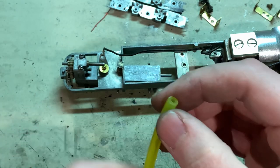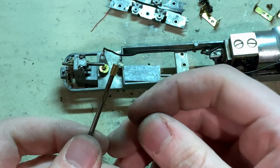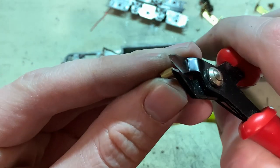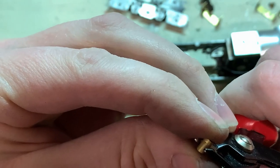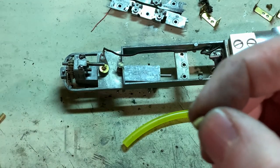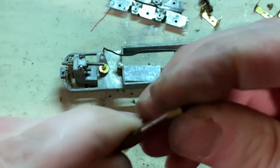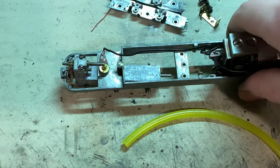The only problem is that the hole is a little too large for these shafts, so what I'm doing is adding a little adapter piece onto the end of all these shafts using this 1/8-inch tubing. What I'm doing here, I'm just giving a little squeeze in a couple spots with cutting pliers. So it's got those little dimples in it. And then put it onto there. If I can. Yeah, this one's a little tight. There, so get it started on there.